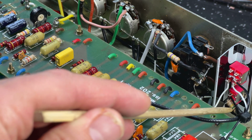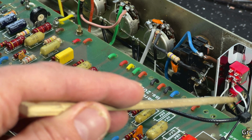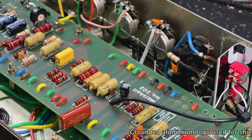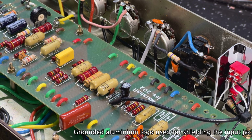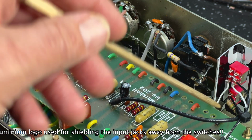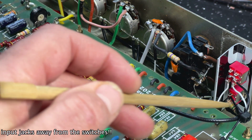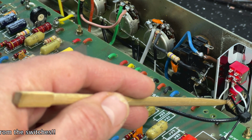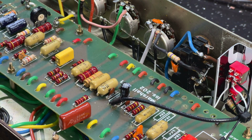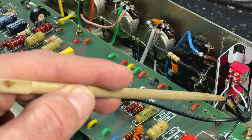So the switch below it is my diode arrangement. Okay, and this is just an on-on switch. This is just an on-on as well, by the way. On-on, so it's either diodes in or out. I don't have diodes out and then two different diode types, whatever. These are quite high value Zeners, not low, so they're around 20 or so. It's a 150k resistor. So that's actually set to ground. I have a schematic on my website where this is actually drawn up. You can see it. But that switch is toggling a ground just for the Zeners.